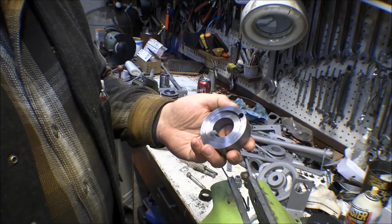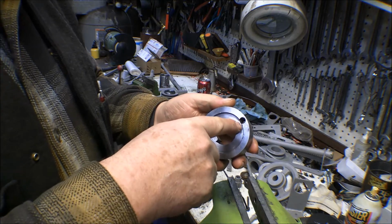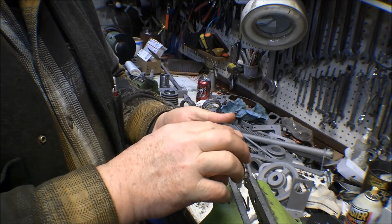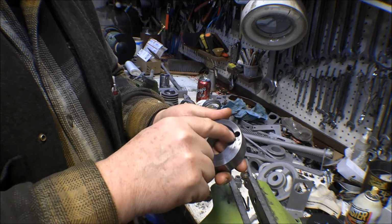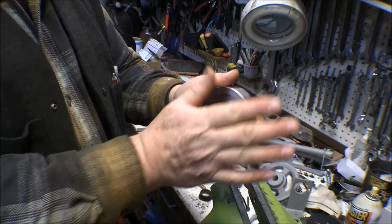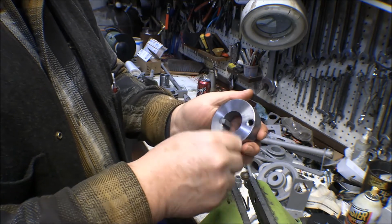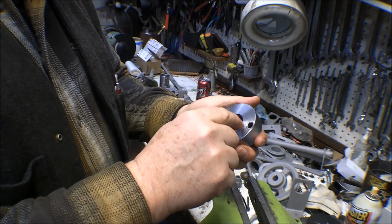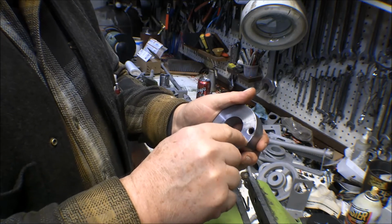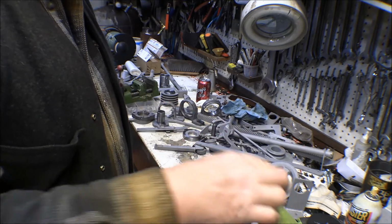And then I took a 5/16 reamer and reamed that hole out. So that is taken care of. And then I took a countersink bit and just deburred this hole here where it goes down in there, because this is the face I want perfectly flat, and it goes up against that saw blade there. And then in this side I reamed it out with the countersink. I countersunk it out quite a bit, and we'll use that to weld in that stud when we put it in. So that's ready to be fixed with a stud in it.